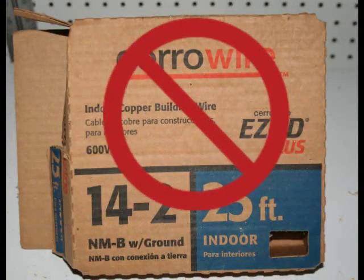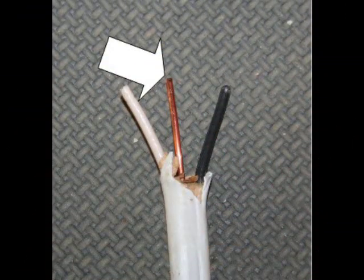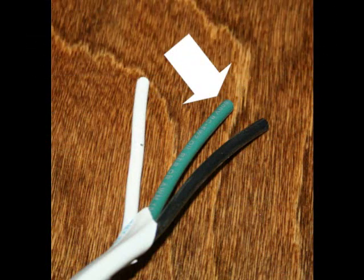Well, now let's talk about the right wiring to use. Now don't use household type wiring. It's just not right. As Jack Hefner from Gratitude Yacht Center pointed out, it's not safe and you're not going to do well on a boat survey with the wrong kind of wire. Here you can see on the household wire the ground is not shielded and it's solid copper. Compared to the marine grade, it's stranded and the ground is also shielded and it's flexible. Now this wire is also tinned so it holds up against the harsh marine environment a lot better.